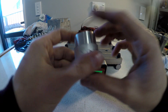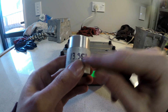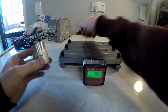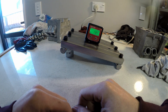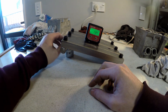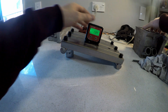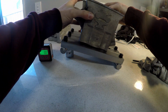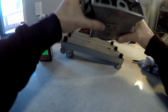I'm going to prop it up and measure some angles to see if it actually does what it's supposed to do. I have this spacer here which is 46.2mm, and in theory the angle of the plate should be 13.35 or 13.36 degrees. The digital protractor only goes to one decimal place so it'll show either 13.3 or 13.4. Put the spacer under there - the protractor is zeroed - and there you go: 13.4 degrees, exactly what we want. So with full-length spacers I can clamp it down at both ends on the mill, check my degrees, and know the precise angle from the spacer height. If I bolt the cylinder head down on the dowels like so, I could drill the oil gallery. This is all going according to plan.